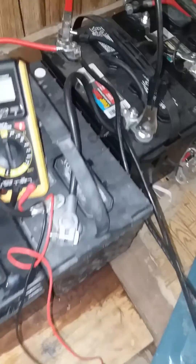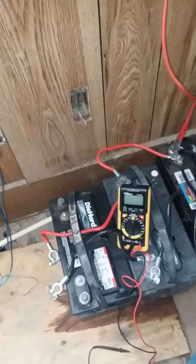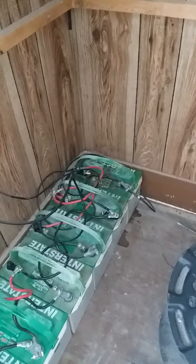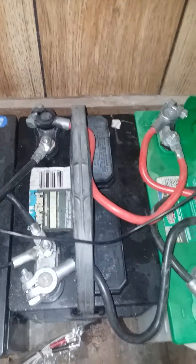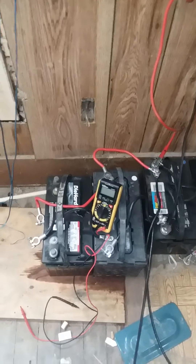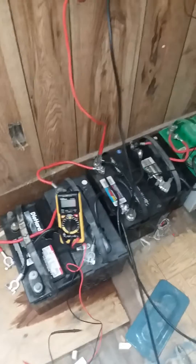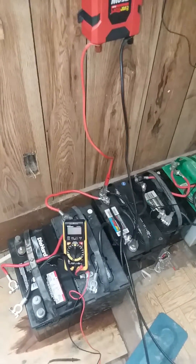I don't have a lot of time left on this video, but it's been working just fine. It's still hooked to this other battery over here. Watch parts one through four on how to clean these — exactly what I did and how I changed the acid out. That's all I did, and I've had those four in the corner in service now for about three months. These two have been about a month and these right over here are just short of a month in service, or pretty close to a month. I have a group 29 and I have a group 24 — that is the only difference I have in here. They're all deep cycle Marine batteries, not Marine cranking batteries. There is a difference, but either way, I just wanted to show you that it does work. This has been charged, has been sitting, and has not lost a charge. So we're going to hook it back up and get it back in the bank and go from there. Just want to show you — you can do it, it can be done. The charge does work and changing the acid works out as well.